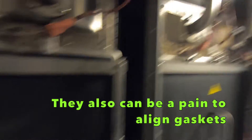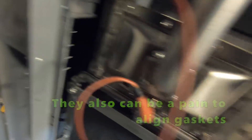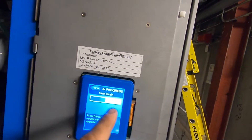When you're going to do this, obviously you've got to drain the whole system down. I've got to open up these huge heat exchanger chamber doors. It's pretty neat how Nortec designed these doors on these units — it can be a little tricky when you're putting the gaskets back on; you wish you had three hands. We've got four here, and it tells you you can manual drain. I'm draining through the system with the manual drain and also through this pump. I've got two other units on this side.